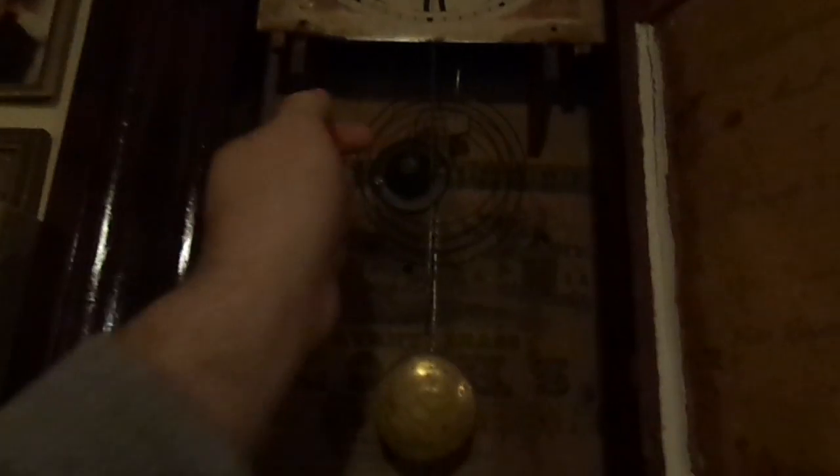Well, I'm going to move it back upstairs. I ran the chime for this video, and now it's out of sync. So, why don't we go over that real quick. This 1847 clock, which is a weight-driven clock, to get the chime synchronized, all you've got to do is press this lever here, just push it up a little bit, and it releases the chime, it'll run one cycle.